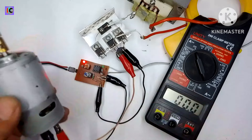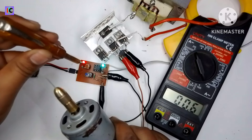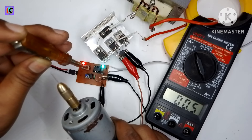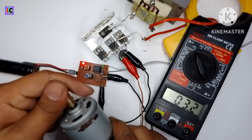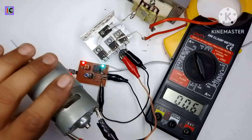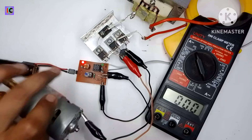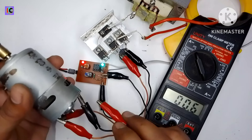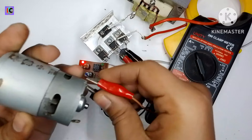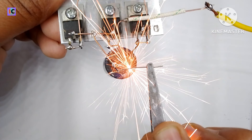Here I'm testing a 12 volt DC motor, which consumes a maximum of 2 amperes. Now I'm decreasing the current limit so that when I try to stop the motor, it will sense the over-current condition and shut down the power supply through the relay, protecting the whole circuit from short circuit. You can see when the power supply is running in normal mode and a sudden short circuit occurs, it turns off fully — very useful protection for any power supply. If you like this video please like and share your opinion in the comments, subscribe to my channel, and thanks for watching.